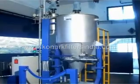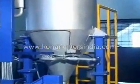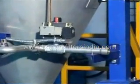After this settling period, the automatic operation of the equipment resumes the cycle and opens this filtrate outlet valve. The clear water filtrate is drained by gravity to the sump for return to the sewage treatment unit.